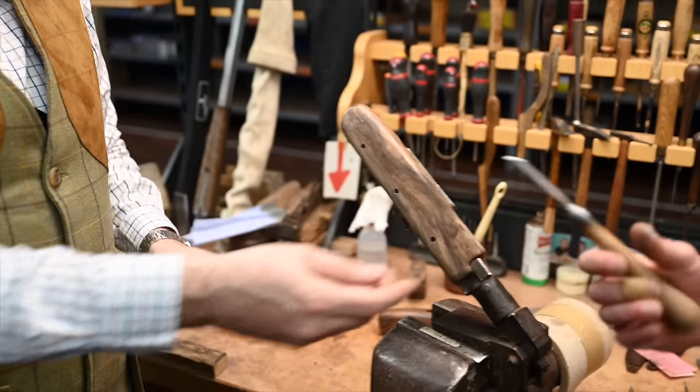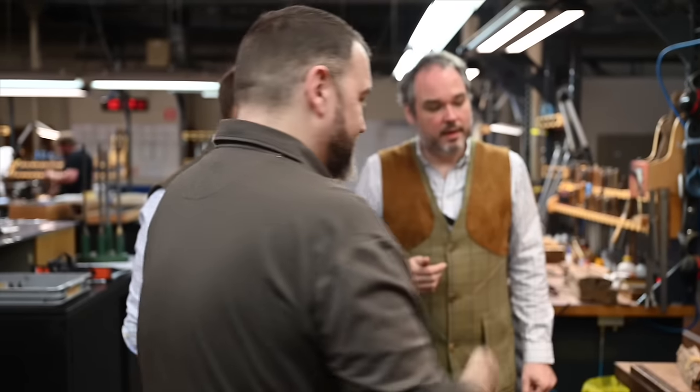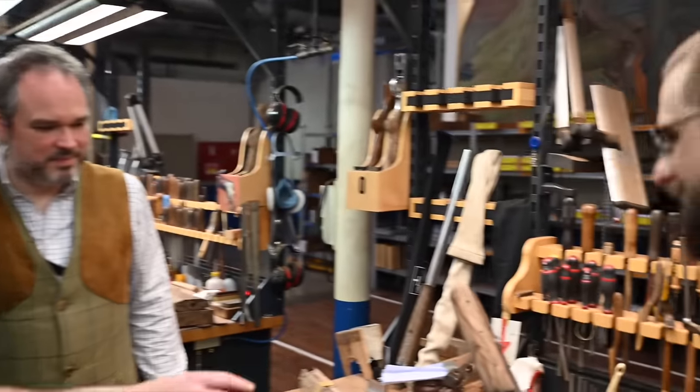It's an extremely difficult operation because the woodwork is finished. And in fact, if he is not deep enough, you won't have the proper diamond points. If he goes too far, he will chop off the head of the diamond, and he will make some holes in the checkering. So he must be right first time. We don't have any buffer of wood to be able to refile to start again. Plus, obviously, all of the bordering, you have to hit every border perfectly. And we saw all the operations made before, you can imagine already all the cost of that part. So what happens if he goes over the border?